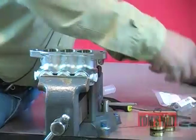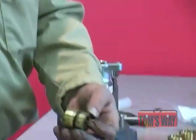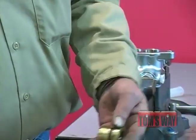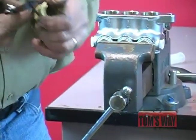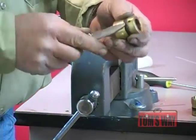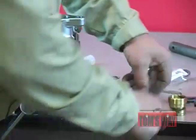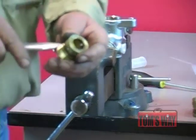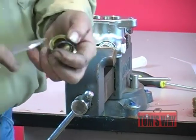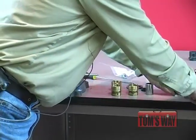That takes care of the high pressure seals. On the seal case, there's an O-ring — you'll actually receive those with the kit too. So they're in the kit, change them. The easiest way to take them off: a pocket knife, razor knife, or screwdriver — anything down underneath the seal and just cut. You can actually peel this off just by putting a screwdriver underneath. I cut mine when I take them off so I'm not taking a chance of putting an old seal back in. I change them every time I put a seal kit in because they're already supplied — there's no reason not to put them in.